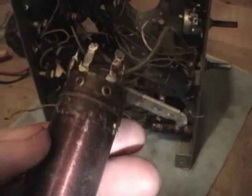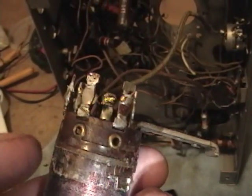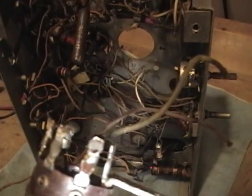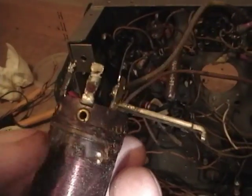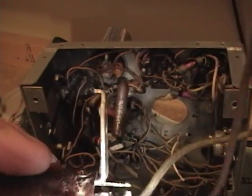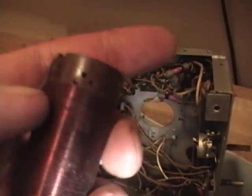As for this coil, if you recall in the earlier video when I ohmed it out, everything was okay except for this winding, which I guess is a very common problem. That is the winding for the shortwave section on the antenna, I believe, this guy. There originally was a plastic sleeve between the larger winding, and that's really deteriorated. And somewhere in there's a break. I'm a little confused by this area too. Let's see if I can illustrate this a little better here.